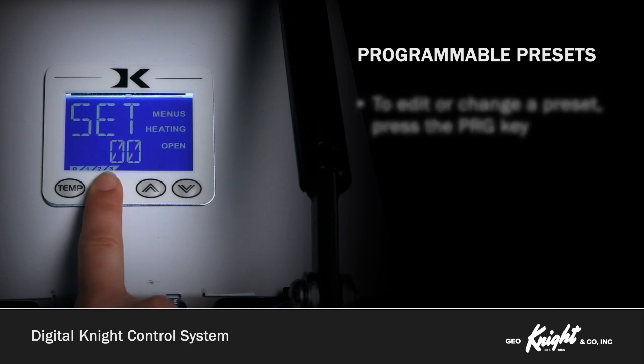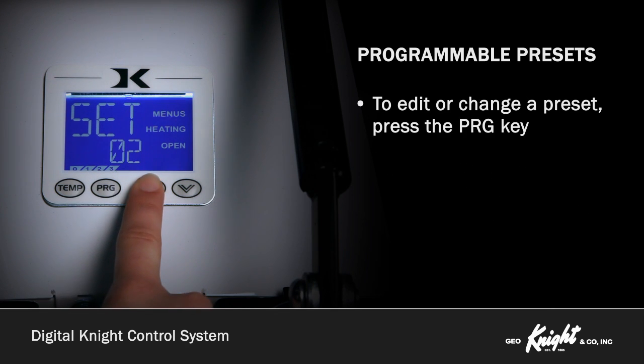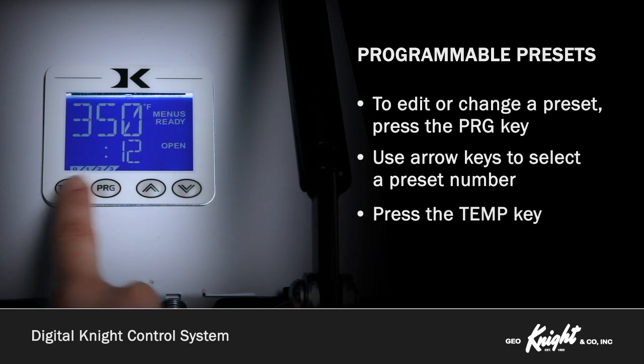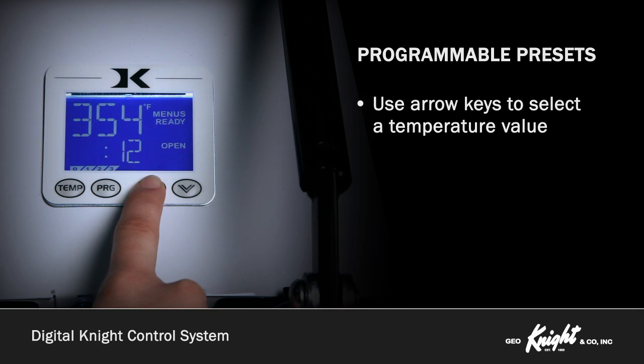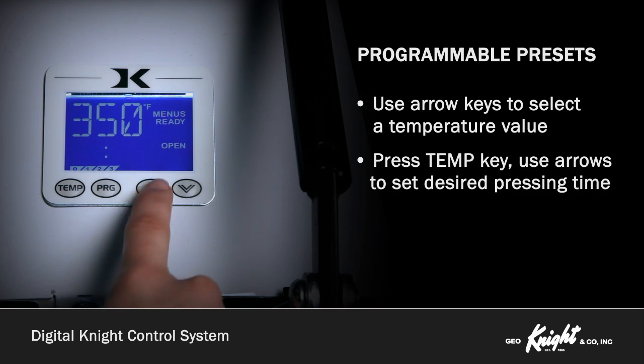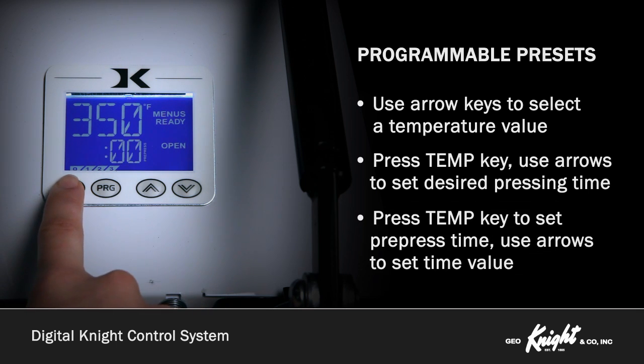To edit or change a preset, press the Program key. Use the arrow keys to select a preset number. Press the temp key. While the temperature is flashing, use the arrow keys to select a desired temperature value. Press the temp key again, and the time indicator will flash. Use the arrow keys to set the desired time value. When finished, press the temp key again.